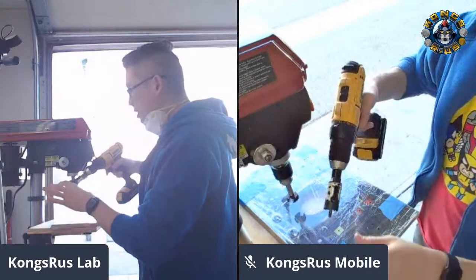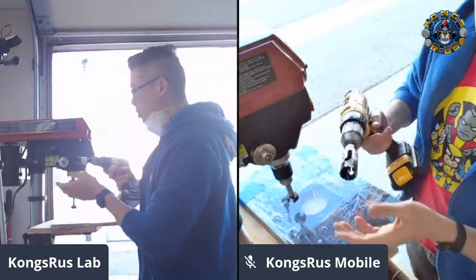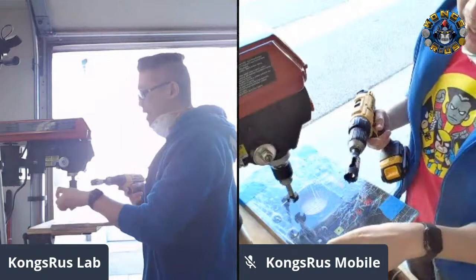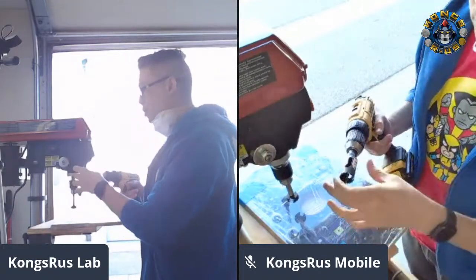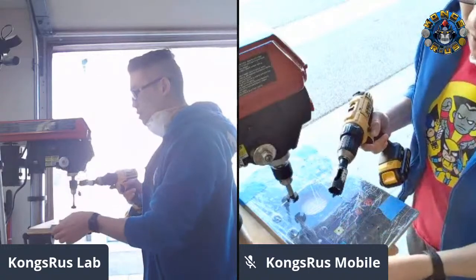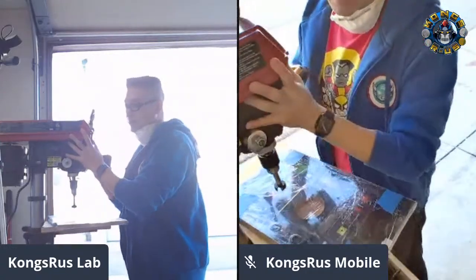And normally, some folks don't recommend doing plexi in the board directly with the hole saw, but as long as you cut through the plexi first, I like to get through the plexi anytime I drill first. And then once I can hear the hole saw cutting through the plexi, I'll stop, pull back, pull out the plexi portion of it, and then drill the rest of the way. So you'll see what I mean in just a second. So I'm going to create a little bit of space.